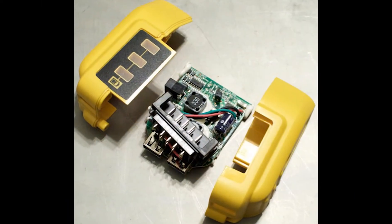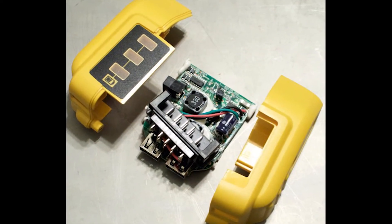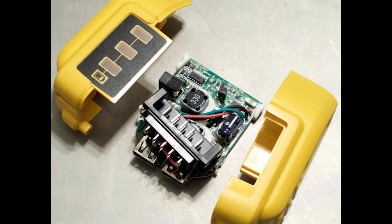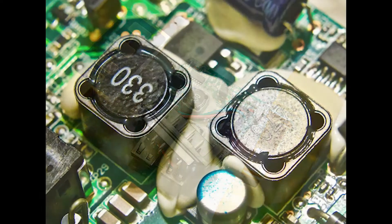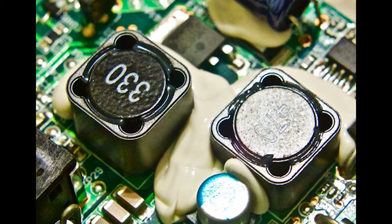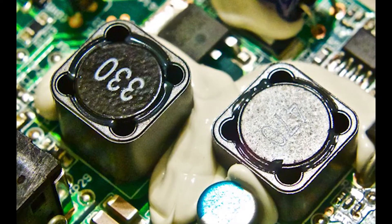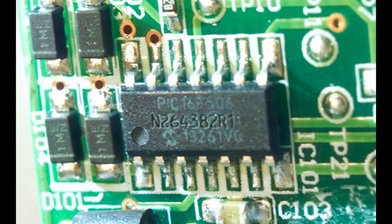I did modify the internal circuit so that the current draw drops to zero when the charger's output current drops to near zero. The modification includes a circuit — a breadboard — that senses when the switching regulator goes into low power mode and then fools the microprocessor with a false low battery voltage signal, thus bringing the current to zero.